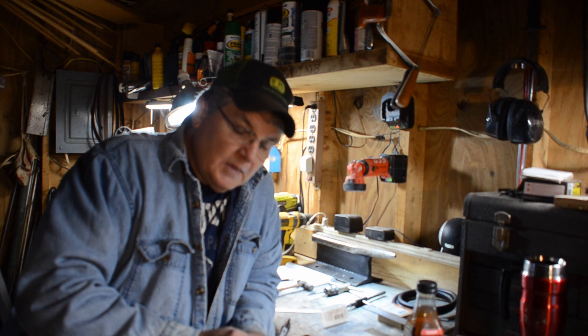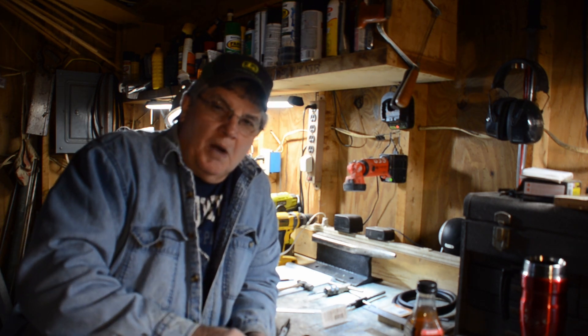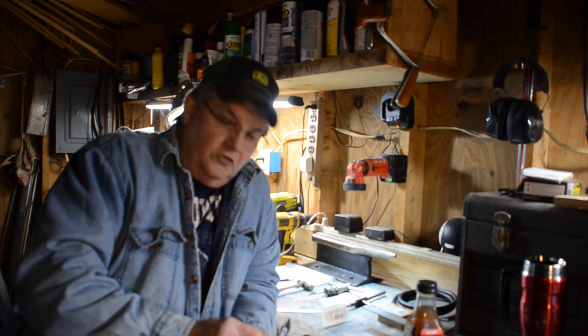Before I move on to the drill press, let's talk about shop safety. We don't want to wear gloves when running rotating equipment because you don't want to get injured. You're going to have shavings coming out, so be careful of sharp edges. Wear safety glasses to keep shavings out of your eyes. You probably won't need hearing protection for this part. Let me go ahead and set up my drill press and you'll watch me drill the holes.